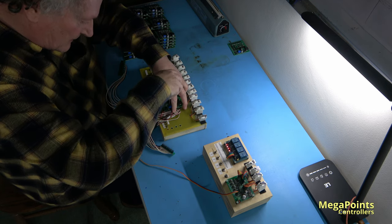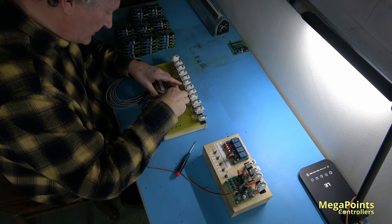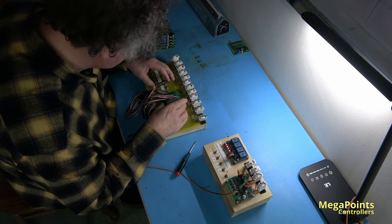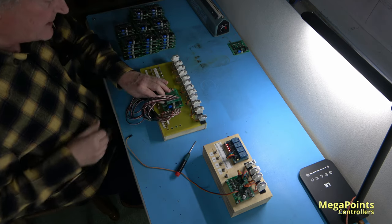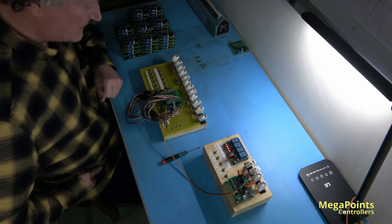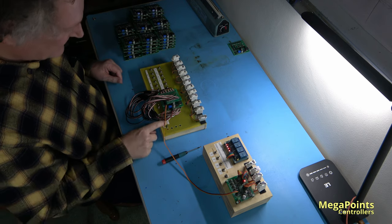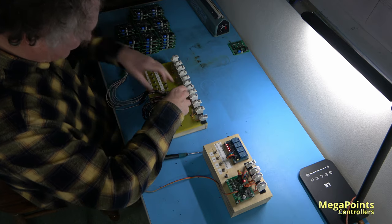So, board on, wired up to power, drop the servo connector on, drop the switch connector on. Factory reset the unit, connect the network, and then 1, 2, 3, 4, 5, 6, 7, 8, 9, 10, 11, 12. Network works, memory works. That's a pass, on to the next.